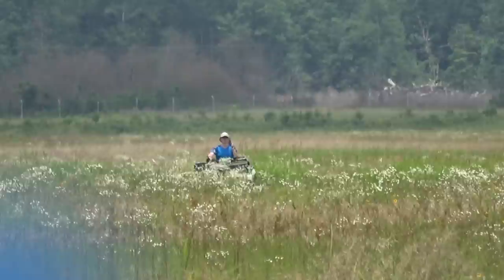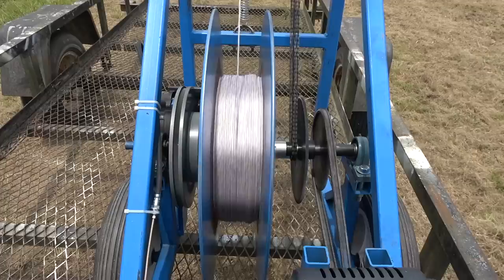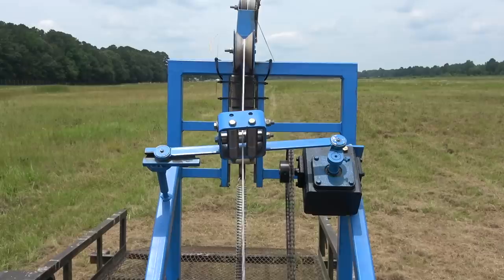The return: once you do a tow release and the drogue falls, you've got to pull the line back to start. I've got Preston — this was his big training day, learning how to be the drogue monkey, going and getting it, how to pull it back. We did a big training session — tow trials this day. Everything was working right. There was a minor thing: I blew a bearing. Those pulleys that you see moving — I actually beefed those up with some bearings that were about five times bigger than what was in there. They should last forever now.